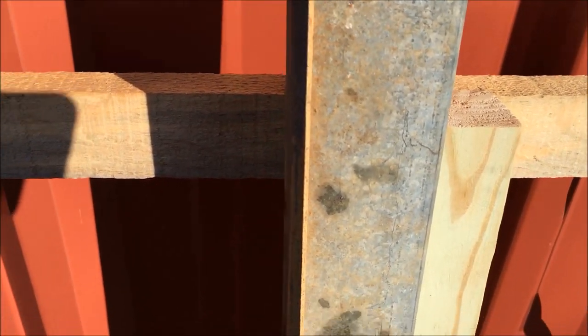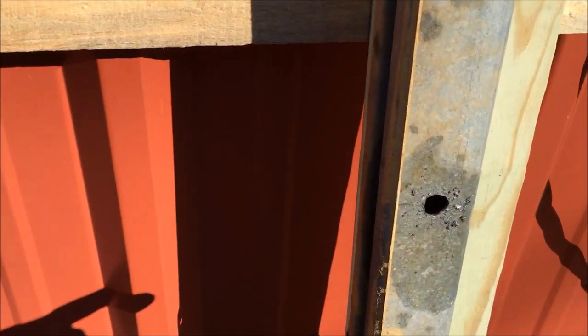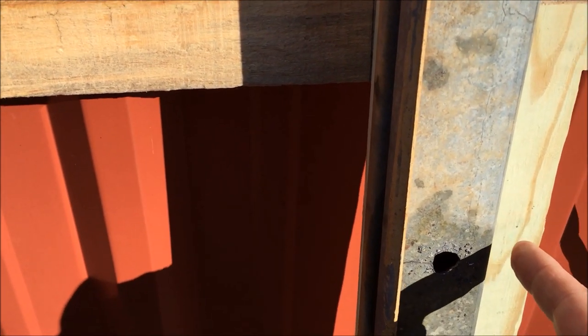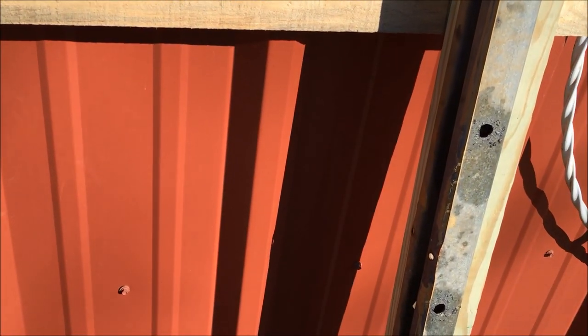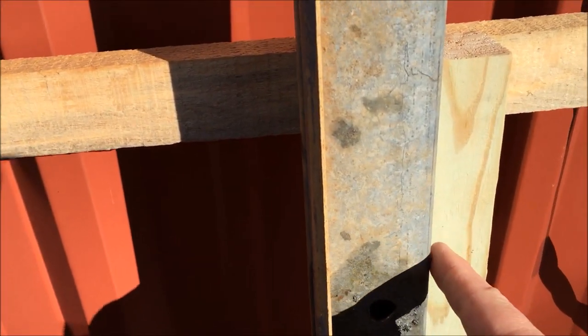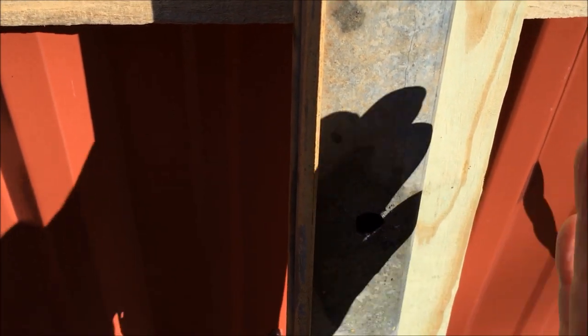This is a 2x4. When I get up to the pallets — the edge of the pallet chute — I'll drill it first, then screw these through here using three-inch screws and screw this to the pallet. The pallet will be behind it, and that should give it enough strength. Plus I will come in on the side here and put multiple screws through from this down into the upright of the pallet.